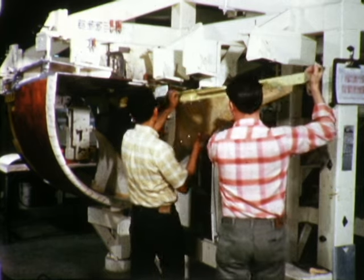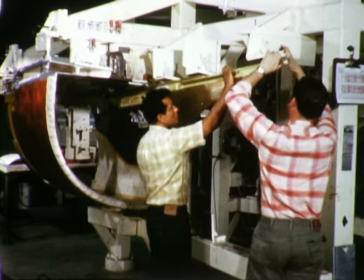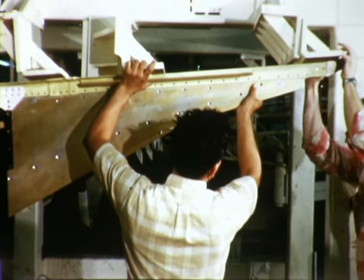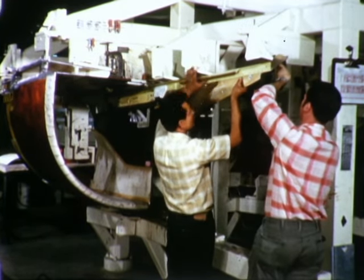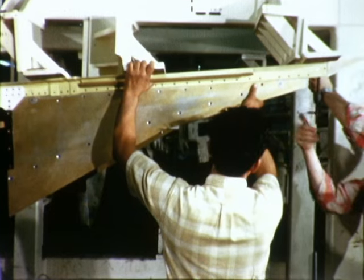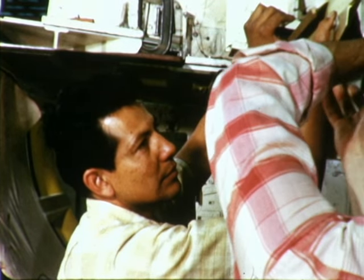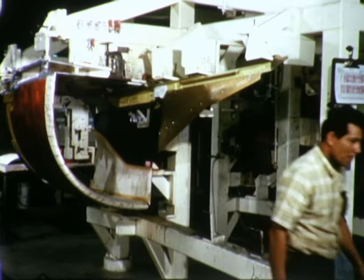The Triple Plow 2 boundary layer system has proved so effective that the splitter plate previously needed to constrain the fuselage boundary layer has been deleted, with attendant savings in weight and drag. The new inlet provides roughly 10% increase in cowl minimum flow area. The enlarged cowl accommodates the higher TF-30 P12 or P7 engine airflows, as well as the P3, and still has moderate margin for further growth in airflow.